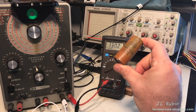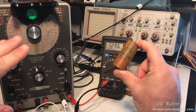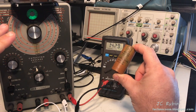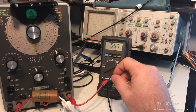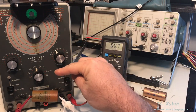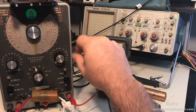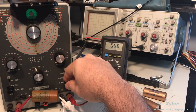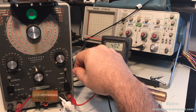I do, however, really want to see this particular one, so I'm going to put this one on the machine, and I'm going to put the IT11 away. I'm not going to play with this all day. Here we go. So not only was this thing leaking electrically, it was leaking literally, right? So we're gonna try. This was good up to 350 volts. We're just gonna start it off at 3 volts. And at 3 volts,